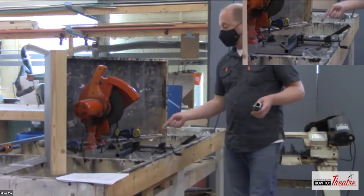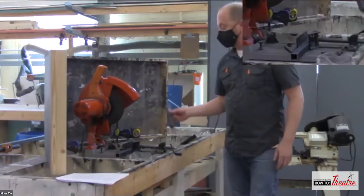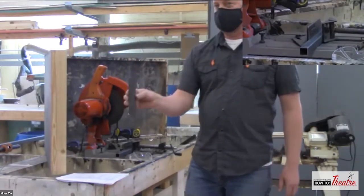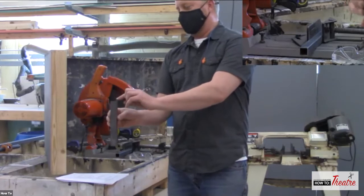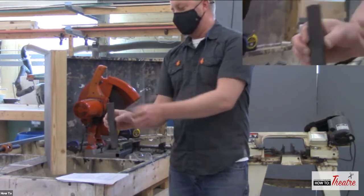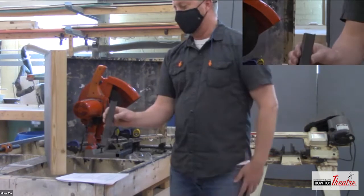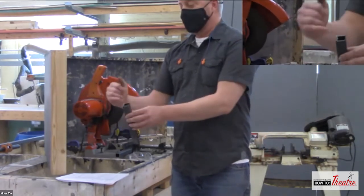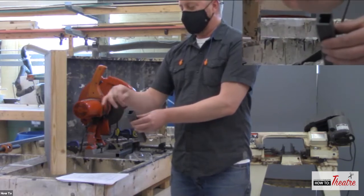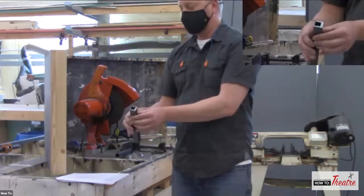After you cut that, that's going to be really hot. So an abrasive cutoff saw is great. The biggest problem with it on the bottom is that you always get this sharp little burr here. So you always want to file that off. You need to be very careful with that because that's just kind of razor thin right there, and you can cut yourself very easily. Even on the inside, you can see that burr is inside there. So a lot of times you got to clean that out because if you leave that exposed, someone could stick their finger in there and again cut themselves.